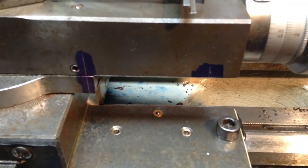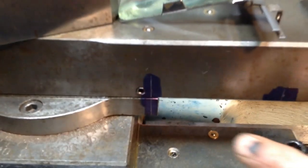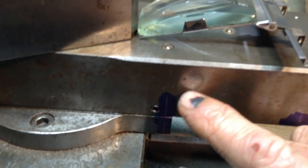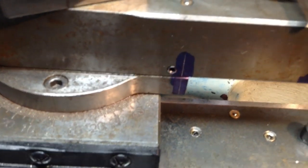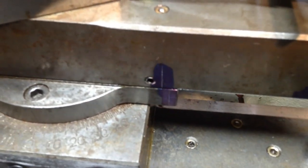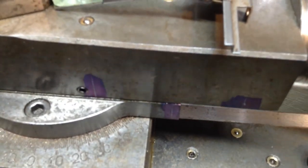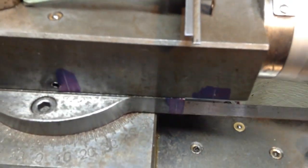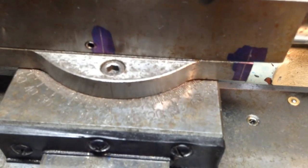We'll put two Sharpie markers on the compound, then I'll get an engineer's square and just very lightly draw a line down there. Then I'll advance the compound 76.2 millimeters, which is 3 inches, and as this line comes up here, I can come up to my dial on the compound